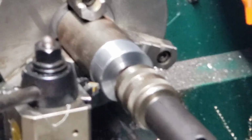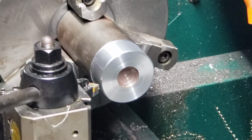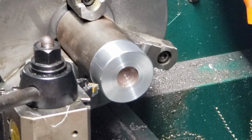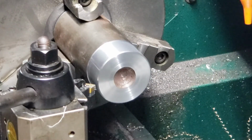2.205 chamfer, and we're going to drill a 7/16 hole. We're going to tap at 1/2-13. 7/16 is larger than what 1/2-13 calls for, but I want it to tap easy because this is not anything other than a stop that I'll never use again. Or maybe, who knows.